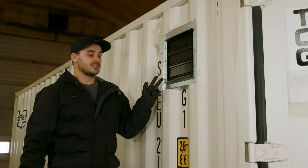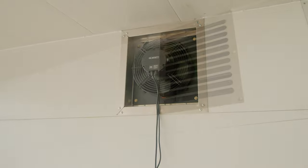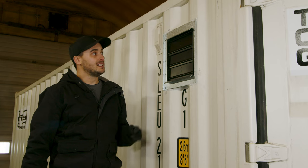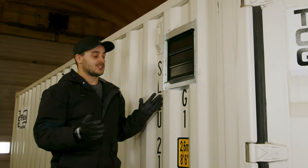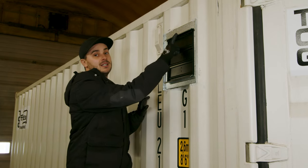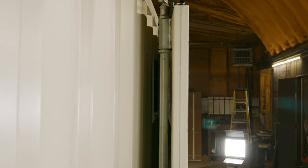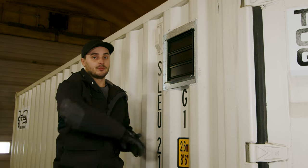So just a final thought on the outside — this is it all buttoned up. A simple product, but very useful and valuable — it serves its purpose very well. One thing to note about the placement of this vent is it's right next to the doors. I always strongly advise customers not to install things within the first four feet because the door swings around and can hit this. The door lock rod actually does collide with the rain drip portion of this frame, so now we have to install something on a corner post to stop it from swinging in the wind and damaging this frame.